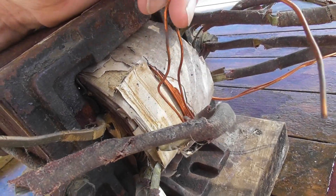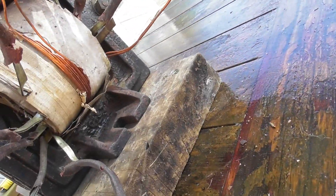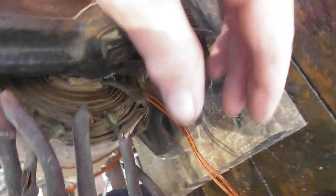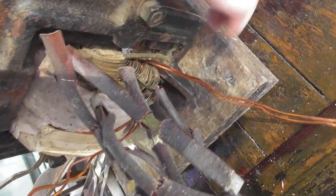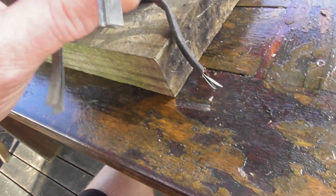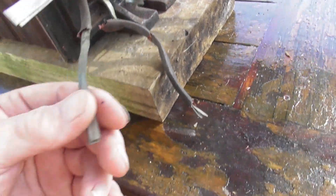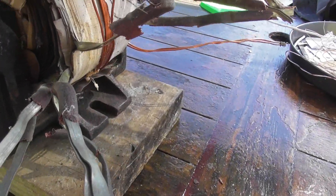That may be the primary winding - there's two winding coils in parallel, and that looks like part of the primary. It sits on the outside and one goes here to the inside. These sit halfway and I'm not sure if it might be 110 or 220, I have no idea. There's a real thick LV winding in here, and these copper ribbons look like tabs because they're probably part of this winding.